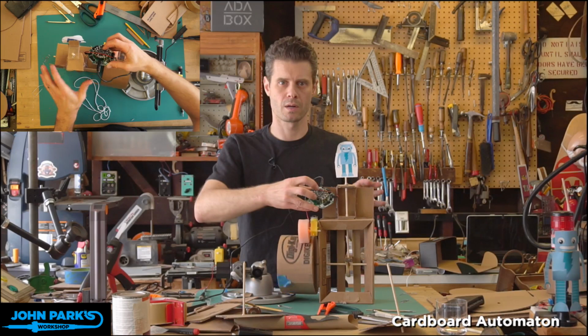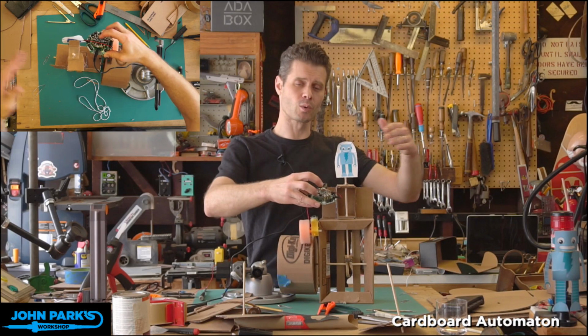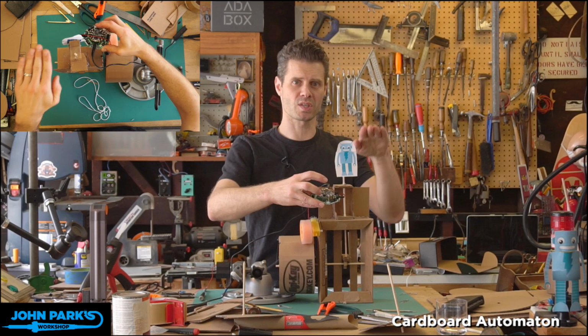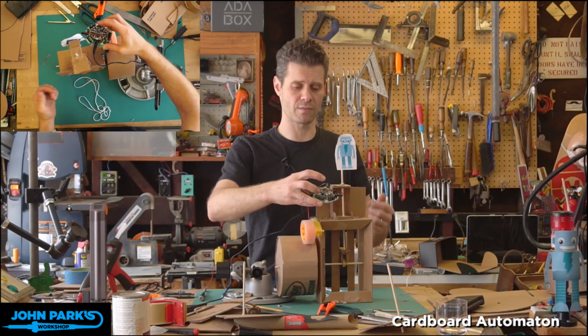So I hope this is a good launching off point for you if you're interested in building this type of automata. Like I said, you could have multiple followers and multiple cams so that you have a rippling motion. You could change the shapes of the cams to get different types of motion. You can see here my character jumps and lands and holds, jumps and lands and holds, jumps and lands and holds. So that motion, instead of just a constant sine up and down, is all based on the shape of that cam. So try experimenting with different cam shapes.